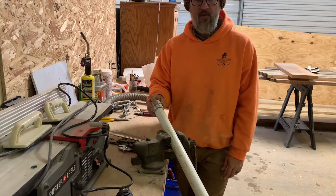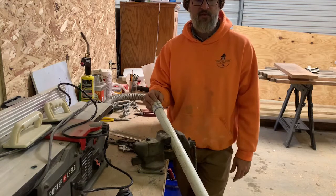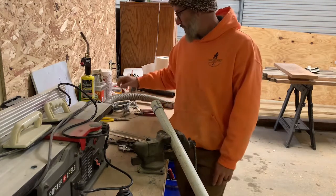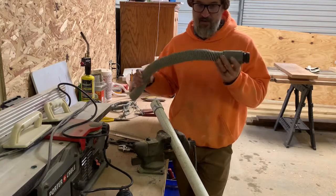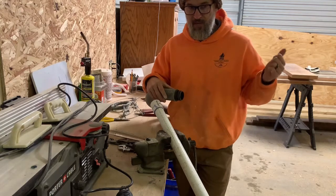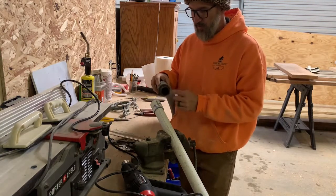So the Lord does provide, even when we didn't know we needed it. Last weekend when we were up at Aunt Laura's house and I went down to the creek, I found this piece of inch-and-a-quarter PVC that somebody upstream had been using for water. It washed out and was tangled up in some trees, and I grabbed it and brought it home, knowing that I recycle as much stuff as I can find. This is going to work great for the vacuum system. My neighbor provided this out of his trash pile — part of an old shop vac hose. It won't quite fit in there, so what I'm going to do is heat it up and expand it. I'll use a heat gun, heat it up until it gets pliable or flexible, shove it in there, let it sit for a bit, and then glue it in.